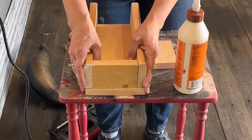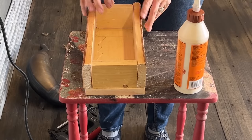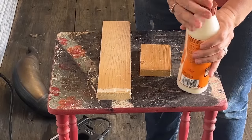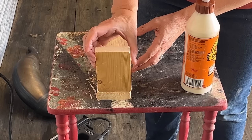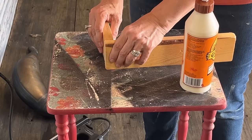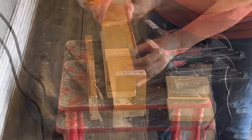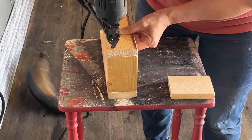I've cut all the wood using my chop saw, which I actually found at a pawn shop — the best place to find tools at a fraction of the cost and they'll still be really good quality. I also found this brad nailer for just $30. It works like a charm, but don't worry if you don't have one — you can always use screws or the classic hammer and nails. There are plenty of options, so just go with what works for you. To secure all the pieces I'll apply a small amount of wood glue and then use my brad nailer to secure them in place. Once that's done we'll be ready to attach the base.